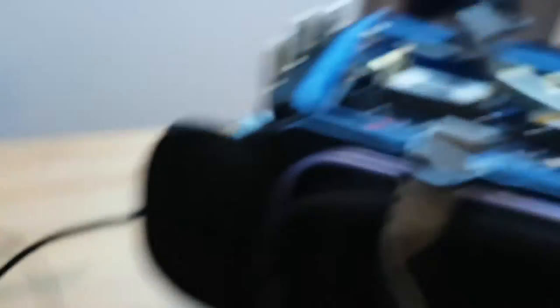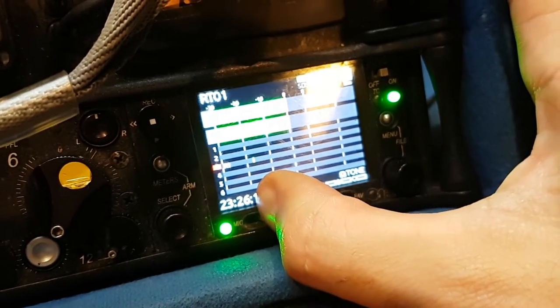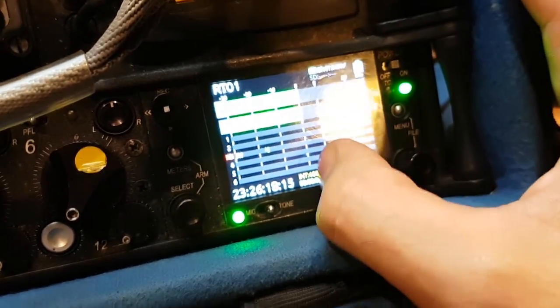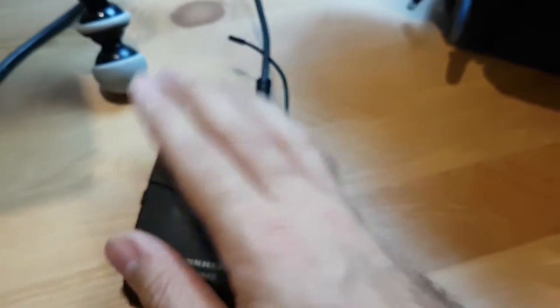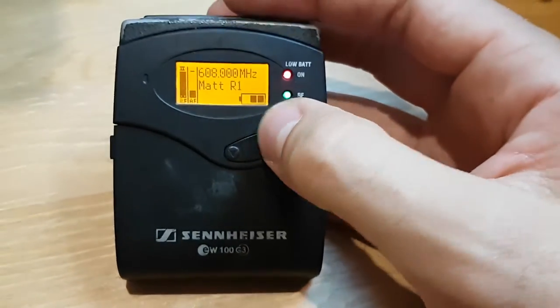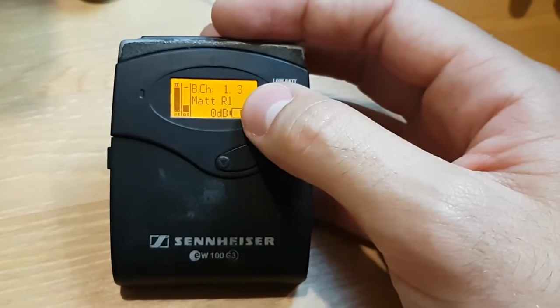So how we did that was: firstly, make sure I set my levels right and obviously listen to them as well. Important to plug this in every now and again for sure. And then once I sound really good, what I need to do is send reference tone. I've got it on solid — this is for minus 20, this thing in the middle here. And I've double-checked that zero dB means it's not adding gain and it's not taking away gain, so it's essentially just transmitting anything I send from here.